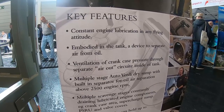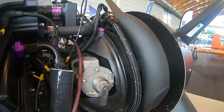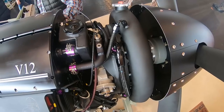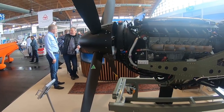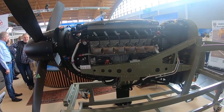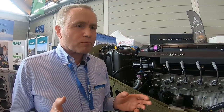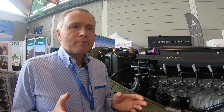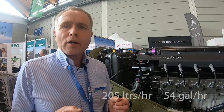The power output is based on how much boost pressure you're using and the RPM, but it will start from 650 horsepower — probably we could end up at 720, something around that area. Fuel consumption: 650 horsepower for an hour requires 205 liters of fuel.